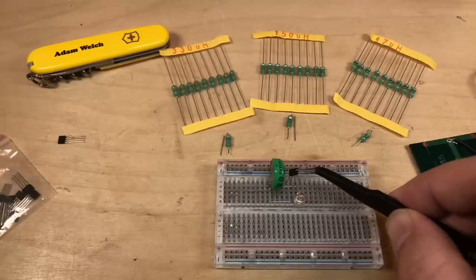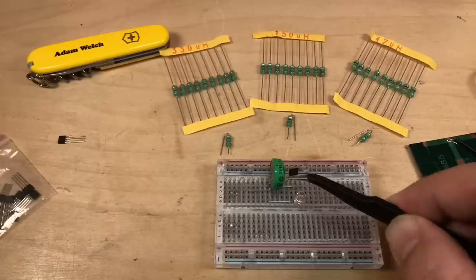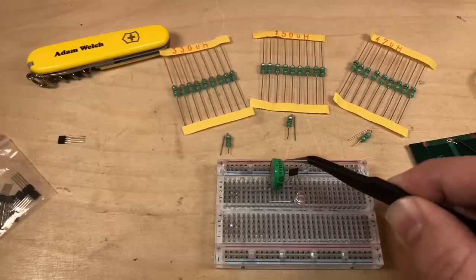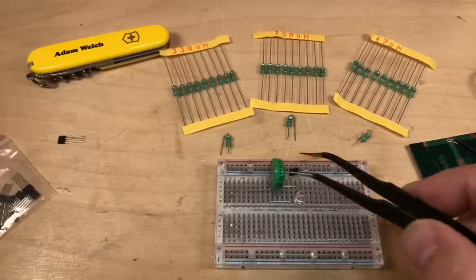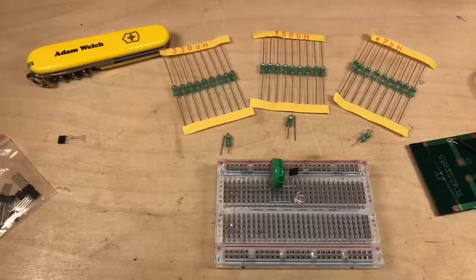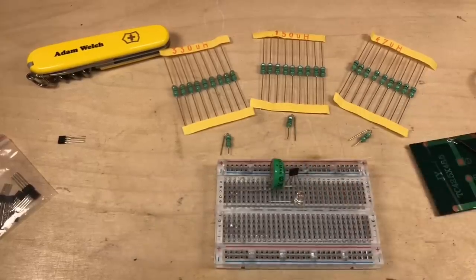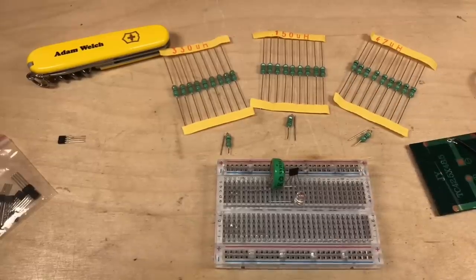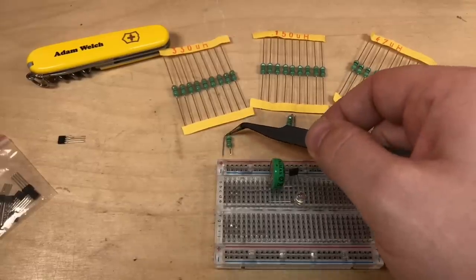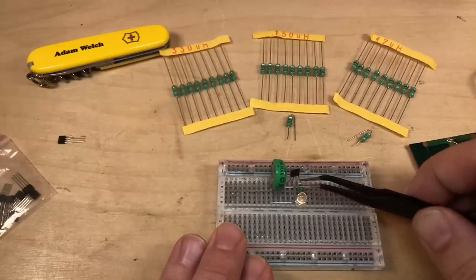I've got a cell, the YX805 and an LED and a couple of jumper wires just to make this a bit more visible, hopefully. But the cell is fully charged, so I haven't attached the solar panel at the moment. I know that because, well, I've just charged it. So I've got three inductors in the background, the 330, the 150 and the 47 microhenry. So let's go for the lowest one first, between pins 2 and 4.